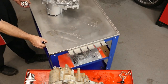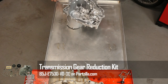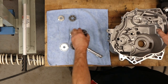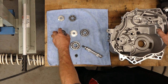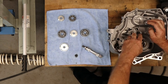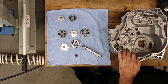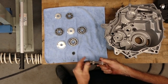I'm going to bring over another bench — a clean one with the new casing — and then we're going to start assembling it. Step number one, we need to press in the new bearings. I've got the bearings laid out where they're going to go in. Keep in mind there are two that are the same diameter; the difference is one has a sealed side, and you want to make sure that goes in the correct location. Let's get over to the press and start driving these in, starting with the biggest one first, then work toward the smaller ones.